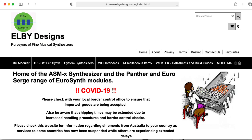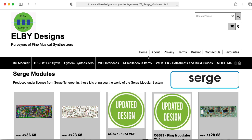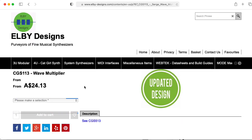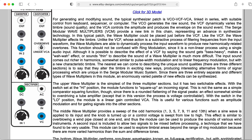If you would like to build your own wave multiplier or other Serge circuit, I would recommend going to LB Designs and clicking on "For You Catgirl Synth Serge Modules." LB Designs took over the sale of Ken Stone's PCBs — both his own original designs and ones based on Serge circuitry. There's an updated design, probably newer than what I showed you. You can either order the board or pay a bit more and get the board with a bunch of components. You can also get the same circuits in a setup designed for Eurorack modules. The kind of wave-folding nonlinearity I've shown you is often called the middle wave multiplier in the original Serge circuit — there were two other weird waveform-distorting sections in that circuit as well, but I won't go through those in this lecture series.